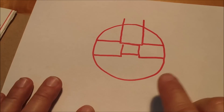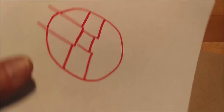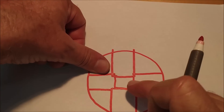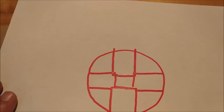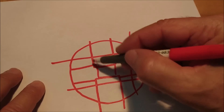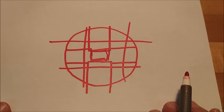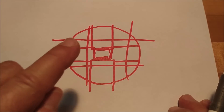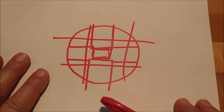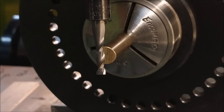The beauty of this approach: on the final pass you have almost 50 percent of the material still intact. As you reverse the part in the indexer and position the cutter back for your final pass, all of that remaining material helps keep the part in line. The final step is a face pass across the four faces to clean up the rounds left by the cylindrical cutter. This is the same concept as extended small-diameter turning, only applied to the mill. Let's set up the dividing head, put a piece of brass in there, and see if it works. First thing I'm going to do is take a light dust cut across the face.